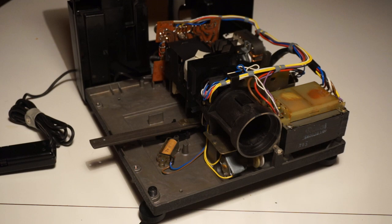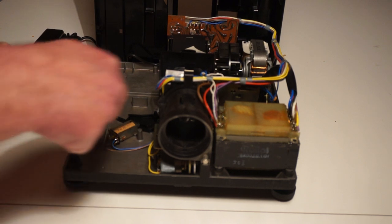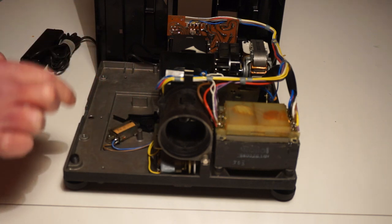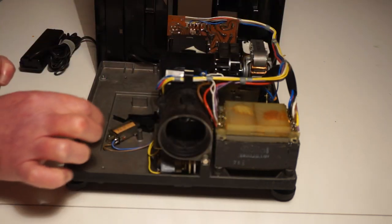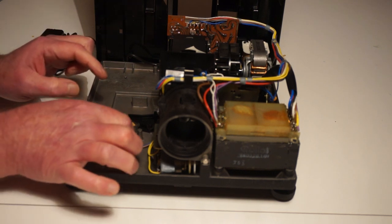To get full access I'm going to have to remove the whole of this section: the transformer which is held down by four screws, the complete front lens assembly, and the slide-shifting mechanism with the worm gear. I think that's all going to come off as one big lump, giving me access to everything from here and back. The transformer has four screws, the lens assembly has a screw here and two down inside - so taking off those seven screws should let me lift out the whole front section.